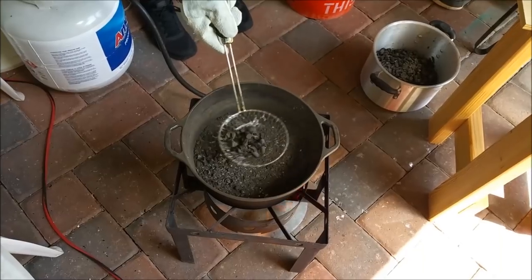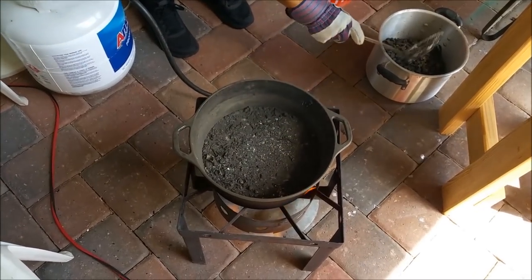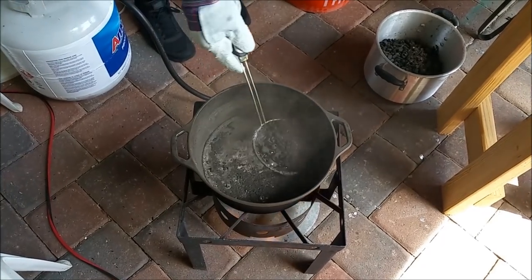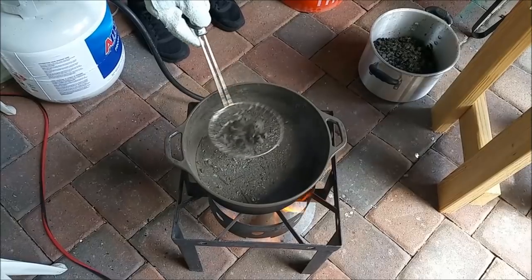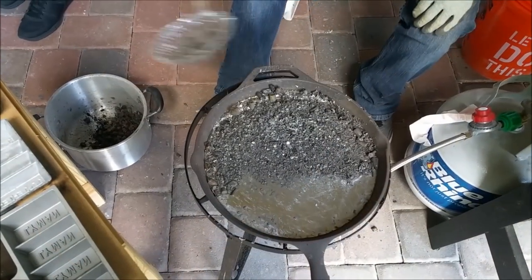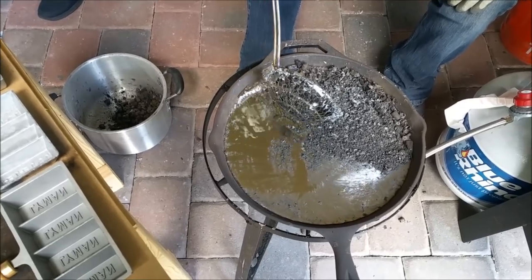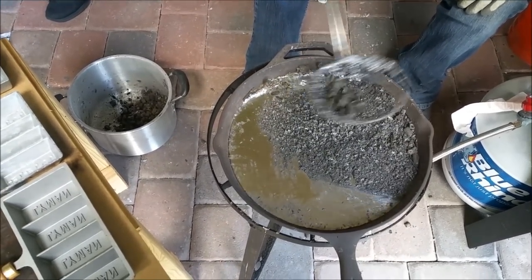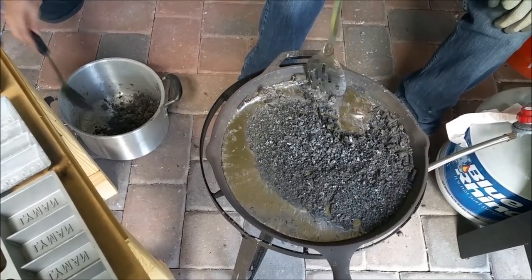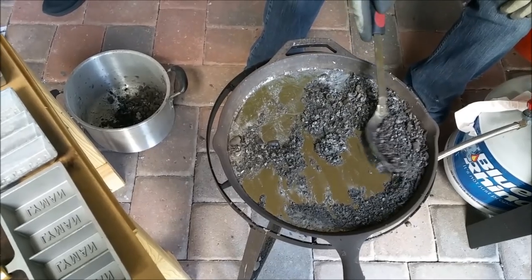Skimming the jackets and the debris off the top of the pot that's melting — this is the big one, I think it's like five or six quarts. We'll do a lot more in this one than in the skillet. You can see there's quite a bit of debris. We've got 550 pounds, but the yield will probably be just over 400. Just about got enough in here that once we get this skimmed off, it'll probably be enough to start pouring them into ingots. We'll get this last bit cleaned up, flux it, and commence to pouring.